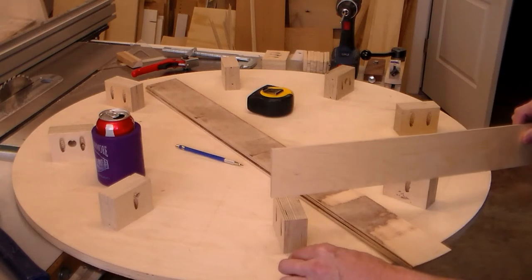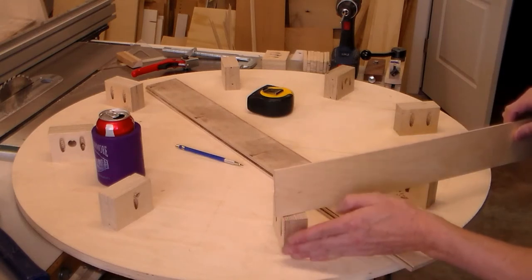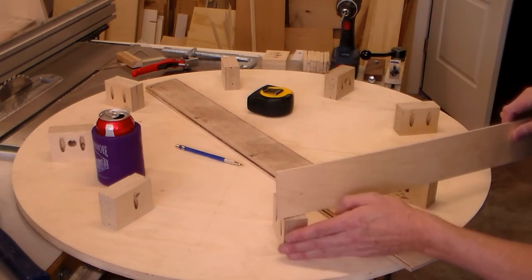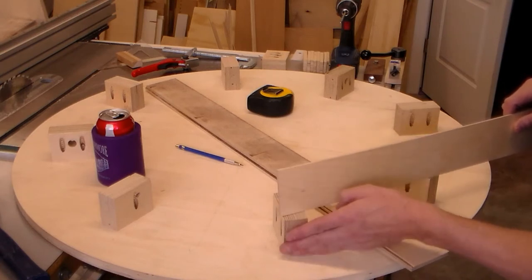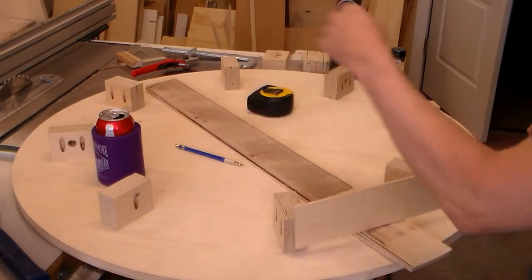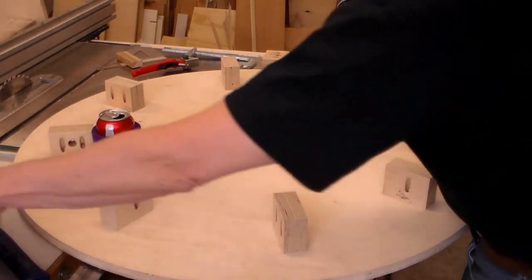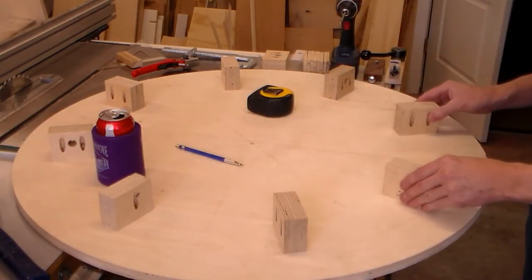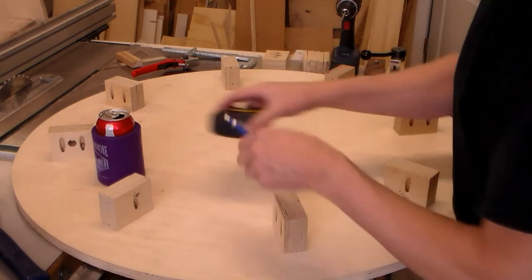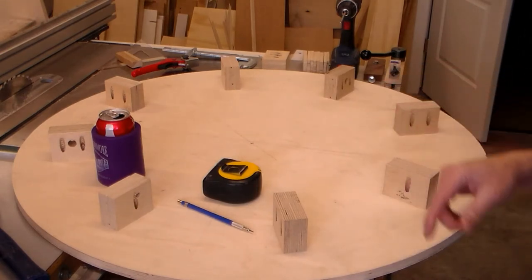I'm just going to put a little piece of solid maple, a hard, solid piece of hardwood. Just make a little strip to cover that joint, and do it in four locations. And I think that'll dress it up pretty nicely. So let me get my pieces ripped, and when we come back, I'll dry fit a couple and see how it's going to work out.